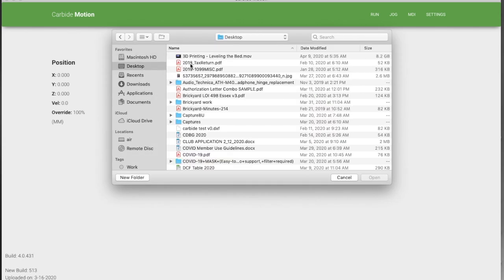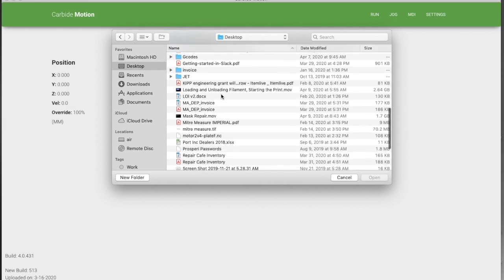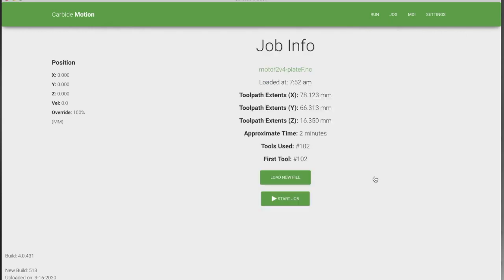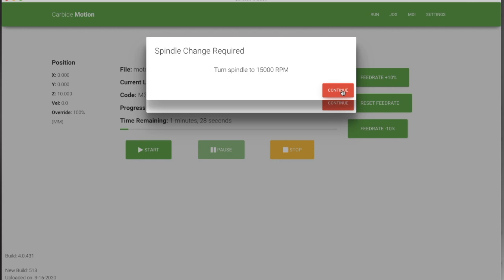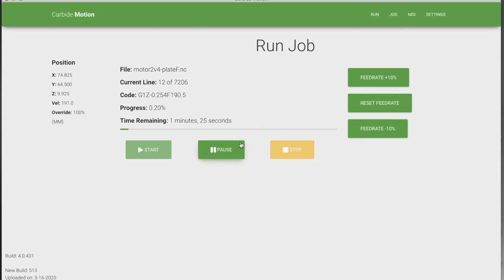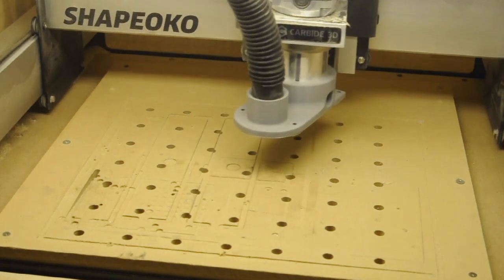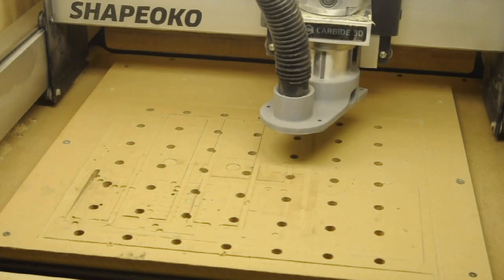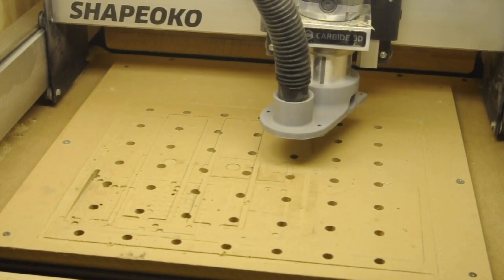You load your job — somewhere on my desktop, there it is. And if it loads successfully it'll show you all the parameters of the job. Then you just start the job. It'll double check your bit to make sure you're running the right bit — that would be the bit that you specced in the software earlier. It's not a bad idea to sort of run the system through without even stock there, just to make sure that everything's nice and happy.